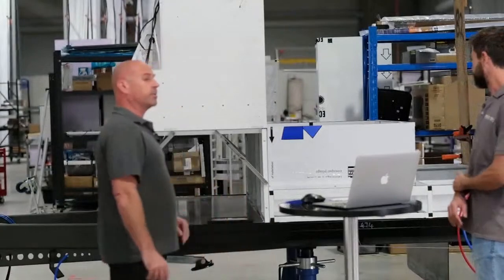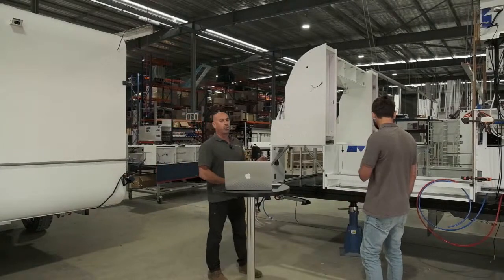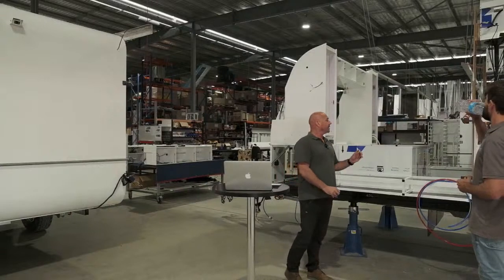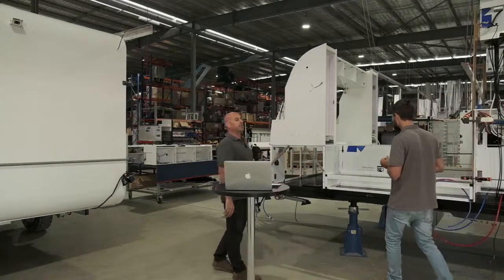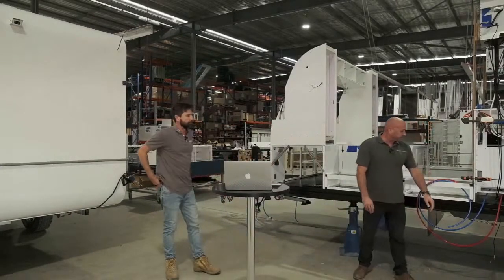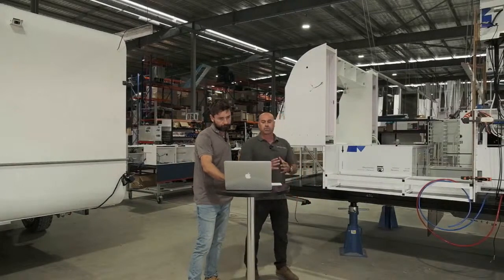The main reason that we build the vans inside out is that we can actually build it in sub-assemblies and components. We have access to all our wiring and our plumbing at any one time. People can be working on the outside of the caravan while they're installing things. And what it does mean is that it's not five or six guys clamping over each other inside the caravan. It means that we can get our quality right. We can see all our fixing points, the way we urethane and glue the cabinetry to the floor. That's a main part of our structure, is we actually glue all our cabinetry to the floor because we don't have any frame structure within our walls.